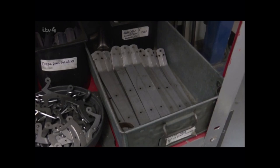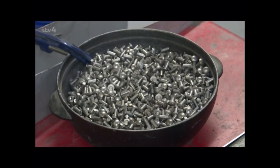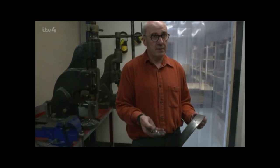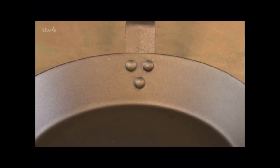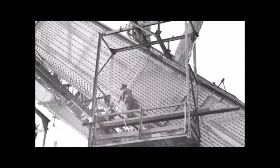With the holes punched, it's time to attach the handle, and that's done with rivets. We use soft iron rivets made for us by a guy in Birmingham. Once produced, they go into a furnace, heat up to red heat, then cool down for hours and hours — so they're properly annealed, meaning they're soft. They'll form a beautiful mushroom shape when we hit them in the next process. Rivets are one of the oldest, most reliable ways to join metal. They were used to construct some of our greatest feats of engineering, and are still used in their thousands when assembling aircraft.